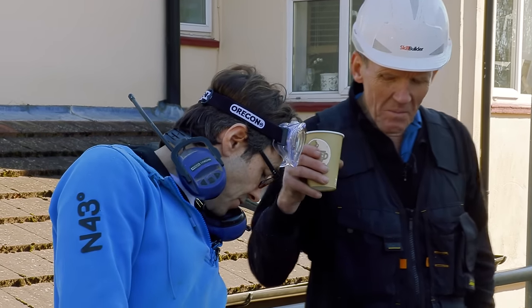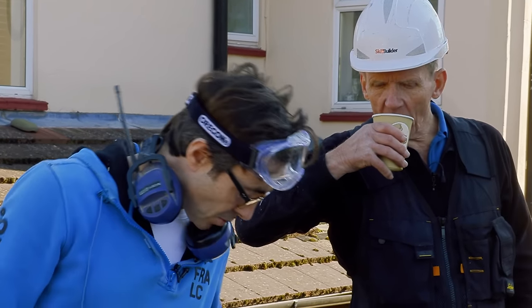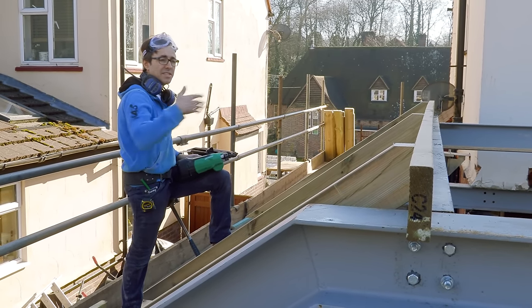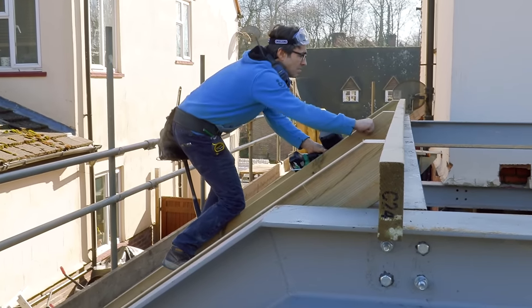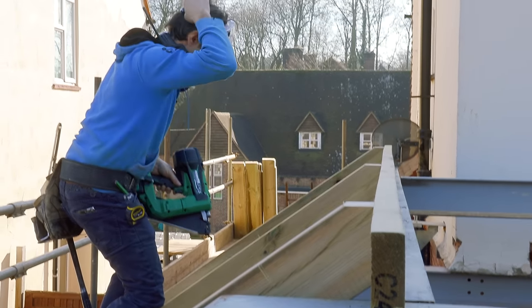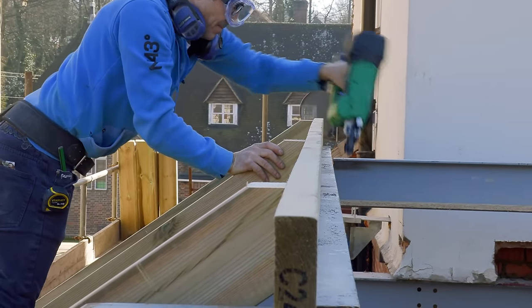I'm happy with that position there, so I'm going to put a mark somewhere and we're going to bolt that ridge in. But before we bolt the ridge in, we're going to straighten it up by putting the rafter in the middle — then it'll be nice and true, and the plate will be nice and true. There's a little bit of a bow in the ridge — timber's always a bit waney — but as soon as you put in a few more rafters, providing the plate's nice and straight, you just give it a little tap, bring everything flush, and you should have a nice straight ridge.